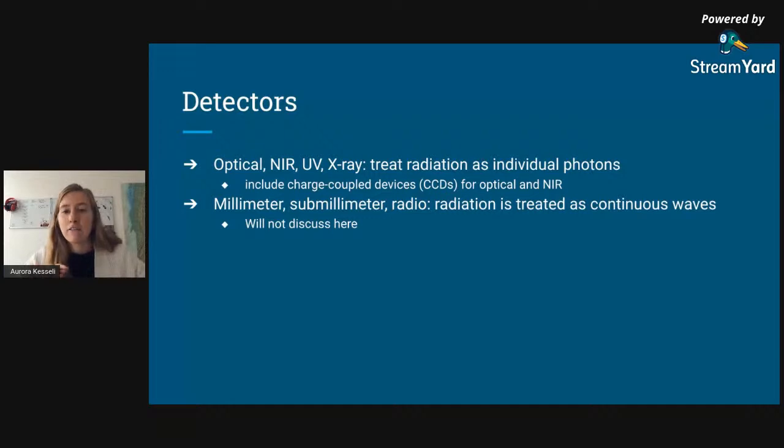And for the slit itself, you want a pretty narrow slit because even in that initial step, you want to spread the light out. For a lot of these high resolution spectrographs, you can choose the size of your slit based on how high of a resolution you need. If you only need a resolution of 12,000, you can choose a slightly larger slit so you get more photons. If you need the highest resolution, you want the narrowest slit, and you're going to lose a lot more photons that way. But you need to do that if you want the highest resolution.